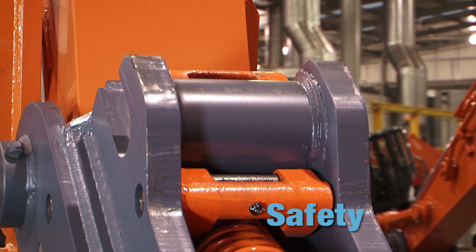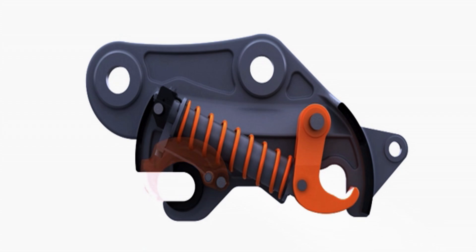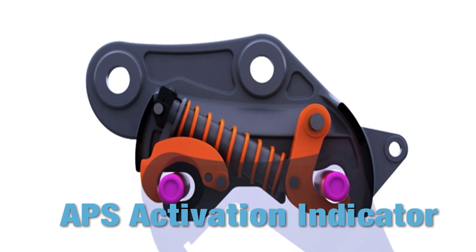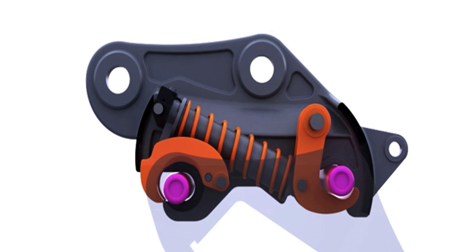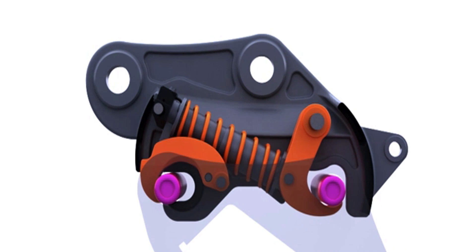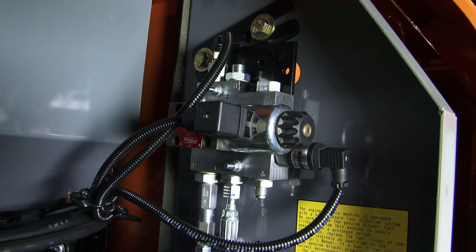The Hill active protection system consists of two powerful springs mounted on the cylinder. These constantly apply pressure to the coupler hooks, ensuring that they remain in place even if a hydraulic failure should occur. The APS activation indicator warns the operator of a possible failure. In this case, the attachment pins will move slightly in the hooks, although the APS springs will ensure that a release cannot occur.